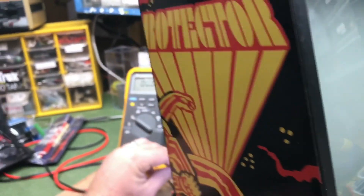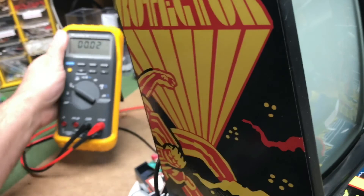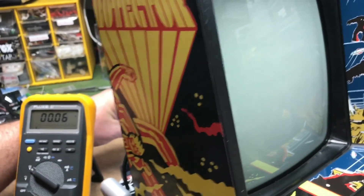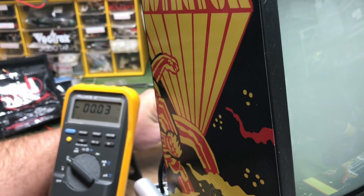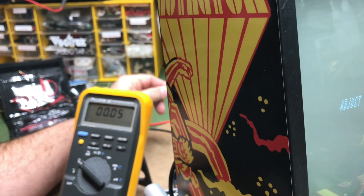Make the adjustments and let off of it quickly. But again, we're only adjusting this when we don't see the actual DAC come up on the screen. And there it goes — I'm only going to adjust it when I don't see it. I'm looking at my voltmeter over to the right. You'll see the light going in and out. We're dark — we're back. I can adjust it now. And I got it on zero. It comes back up — you'll see it go up about 0.09 on the meter.